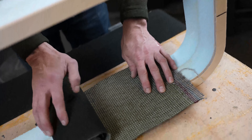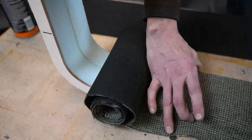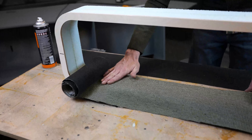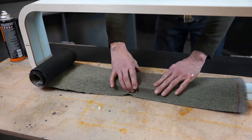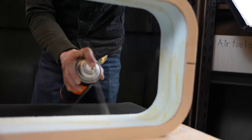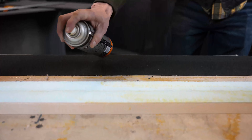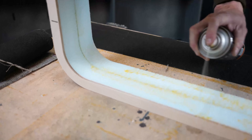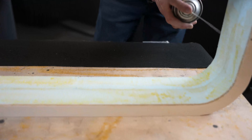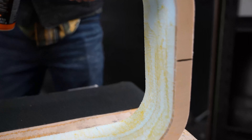It's time to cut the fabric. Fabric should be two inches wider than the frame so that it can overlap either side. The only part that will be exposed is this surface here, but you want a clean edge. Using the FoamFast 74, we'll first do a layer of glue on the frame itself. You want full coverage, but this glue will melt the foam if you over-apply, so not too much.